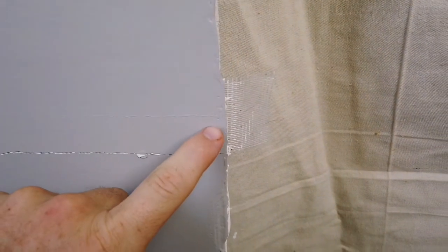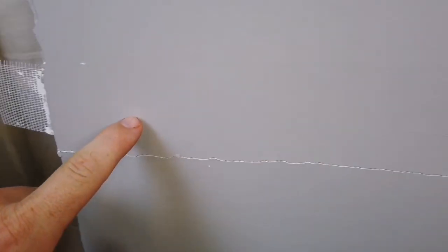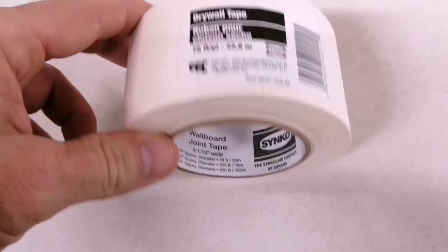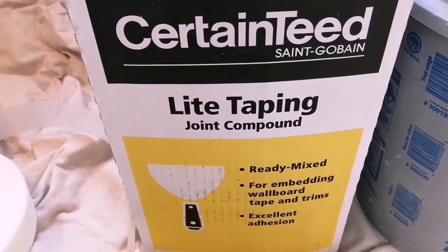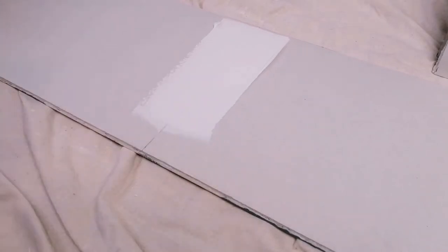The crack is less visible now because the tension is gone. The tape never actually split into two pieces for the reasons I explained earlier. Then, as I added more weight, finally the drywall itself failed. This is drywall paper tape embedded onto the drywall using a drying compound, specifically a taping compound.